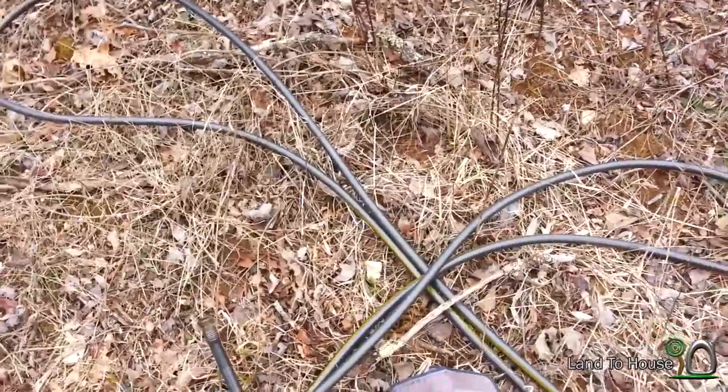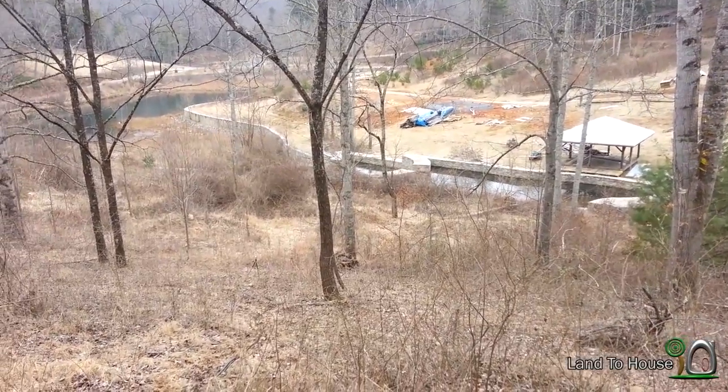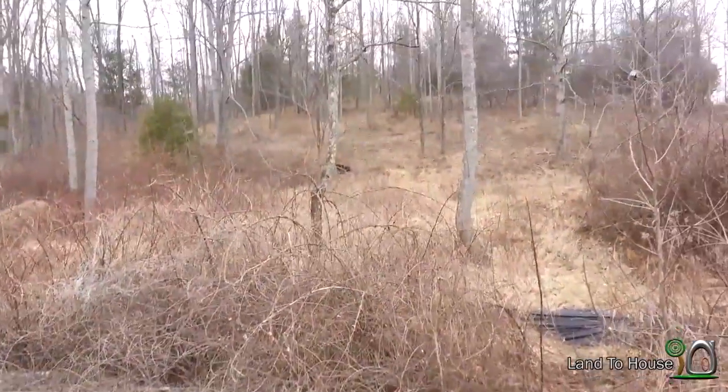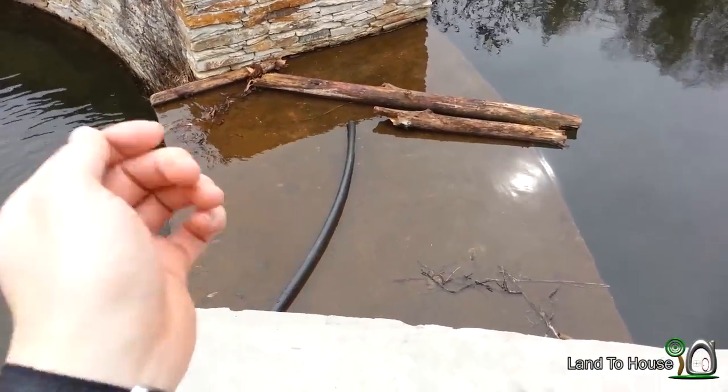This adventure is going to be a little bit anti-climactic. There's so much pressure on my pump right now from the 12 and a half feet that the rubber connector keeps popping loose even though I tighten it really good. But I did get flow here and you can see how high in the air we are — I'm impressed. It came loose from the pump but also pulled free of my intake logs and stopped pumping. We were up close to the top of that hill and it did come through before it popped loose. The pressure was just too great and the pipe was bouncing up and down, which also takes away a lot of efficiency. Not exactly sure how high that was — I'm thinking about 50 feet or so, maybe more.